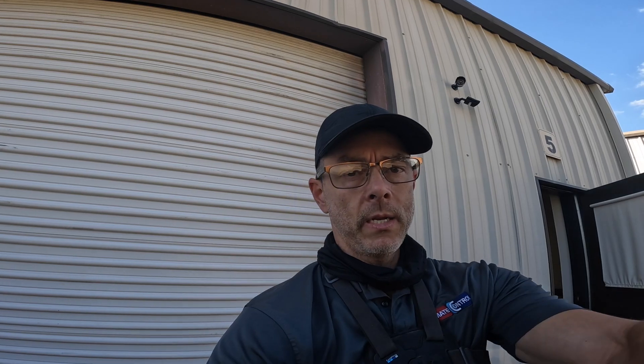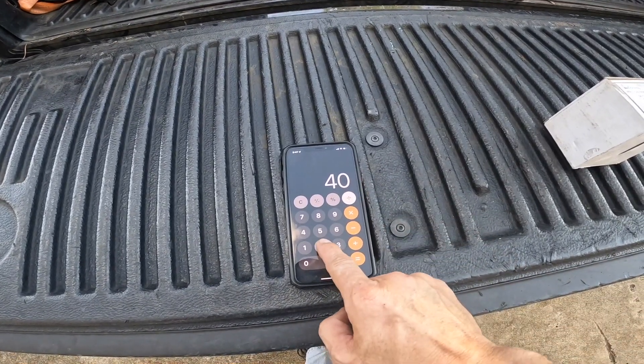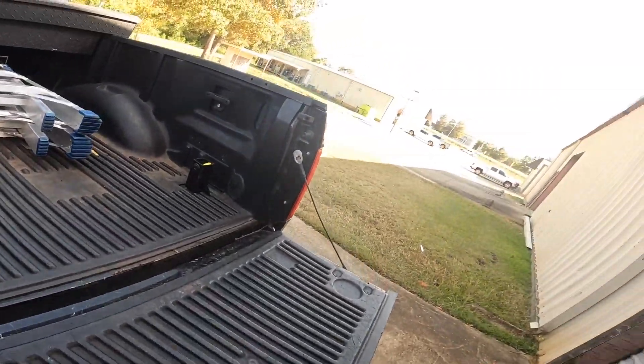That means 40 watts is what it can handle. So you take that 40 and divide it by 24 — we're assuming 24 volts is going to be your secondary voltage. That tells you how much that transformer can handle: 40 VA divided by 24 volts equals 1.67 amps. So it's not meant for high amperage of any kind. In fact, we often put a 3-amp fuse on these.